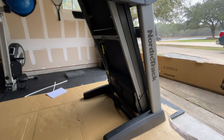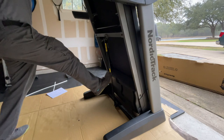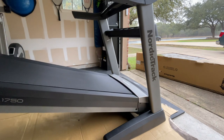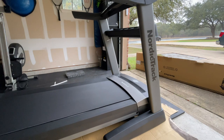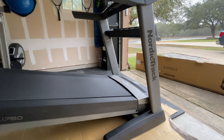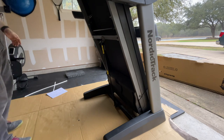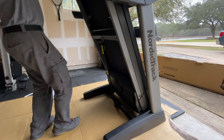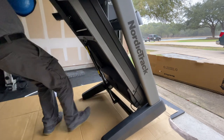The hydraulic is in place. To bring the entire belt down, push it up slightly so you can kick the latch in, and once past that point you can let it go — it slowly comes down on its own without forcing. To lift it up, it's very light now because of the hydraulic. Grab the bar underneath the belt, bring it up, and it'll lock into place — you'll hear it pop. To release, pull down against the latch and lift.